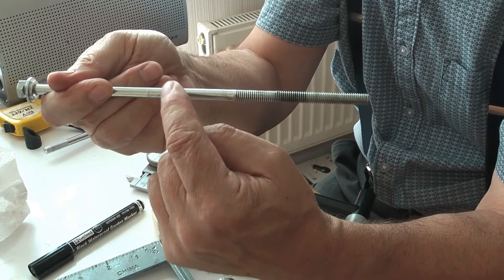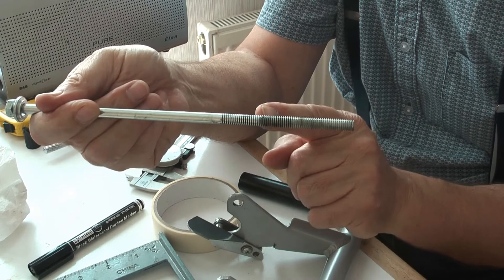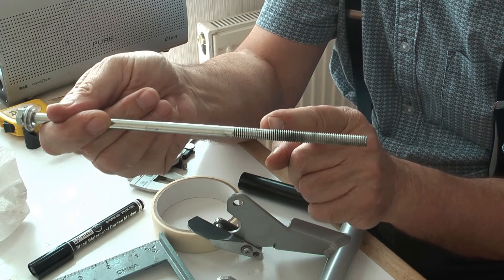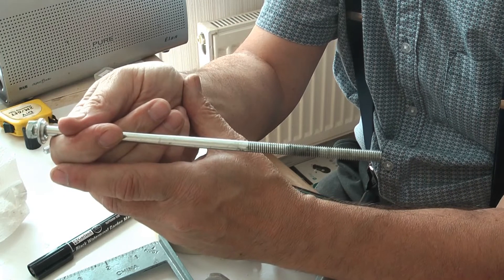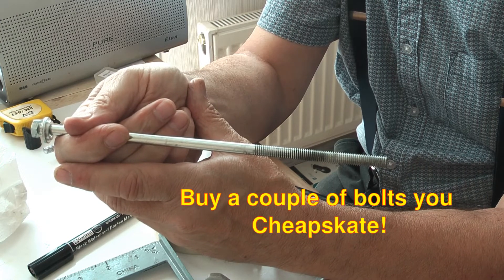We've come to a grinding halt because this stem is narrower than the diameter of the thread. So where it stops it necks down and you can see that the thread that I'm cutting has no crest on it, and that's why it would represent a problem. I've always incorrectly assumed that with part-threaded bolts I'd have the option of extending the thread if needed. In this instance I thought I could save a few coppers and it proved a costly mistake.